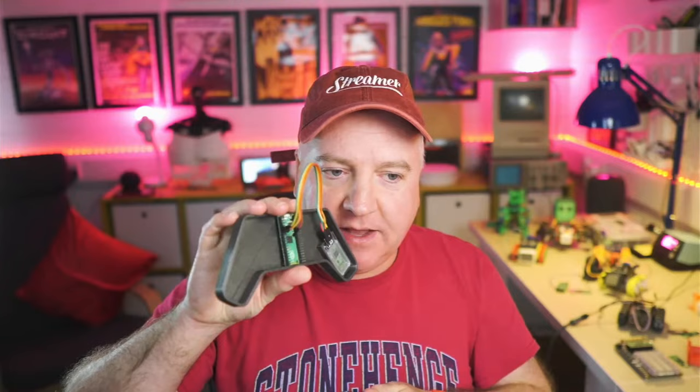This is going to be my SMARS remote. So I've got a little Pico in there and a Bluetooth chip. And one of the issues I've got is if I want to press a forward command on this, I have to write my own protocol for sending that over serial to my robot that's going to listen to that very bespoke language for commands.